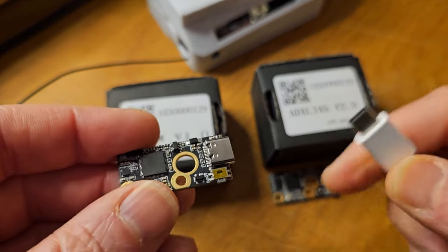Let's run lsusb again. As you can see now, it's not showing Boot anymore — it's just showing the standard RP2040 with a different number. That's why it's important that it says Boot when you're in boot loader mode. You're in different partitions of that chip — when it's in boot mode it looks like a USB drive, but after flashing it shows up as the standard device.